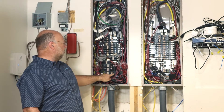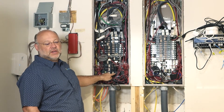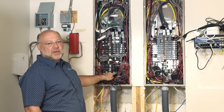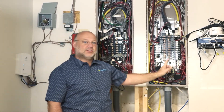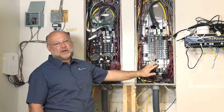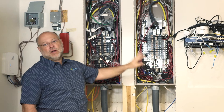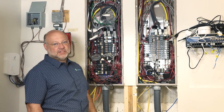What we're going to do is split this into 39 panels on each side, bring half of those panels into each service panel, and back up 20 kilowatts of battery to each — what I'll call whole-home or whole-house backup systems.